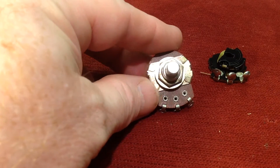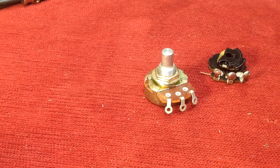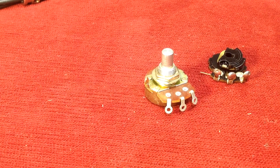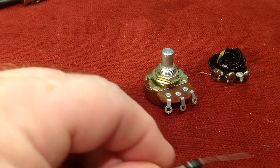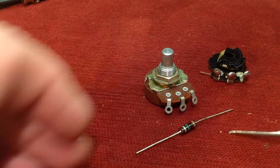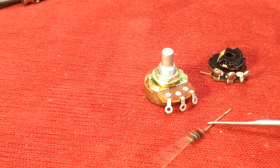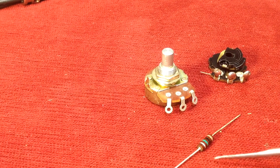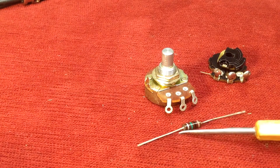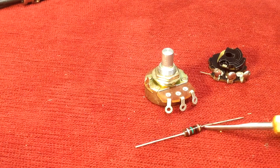There's been a lot of discussion about these little guys in my shop lately, and I just want to go over a few things and make sure that everyone realizes what they are and how they work. The genesis of a potentiometer or a variable resistor is this — a resistor. This particular resistor is a 1 meg carbon comp resistor, and its composition allows it to resist 1 million ohms at a given wattage.